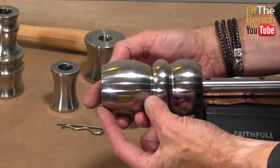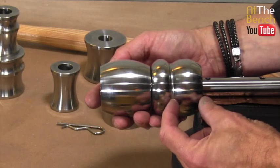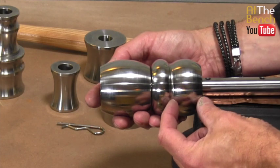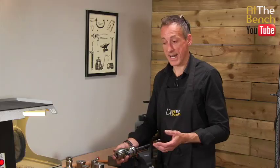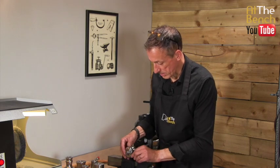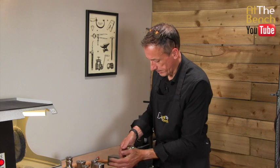We've got quite a nice wide area here for nice wide bangles. This area here, this is roughly around about 30 millimeters, 35 millimeters in width for producing narrow bangles, and this little chap here in the region of about 20 millimeters for a nice narrow bangle. Got the pin put on the outside just to hold that die in place, like that.